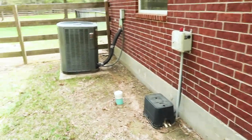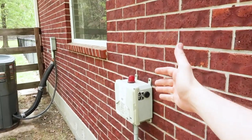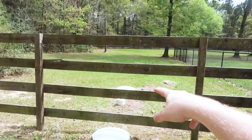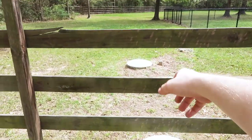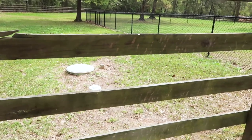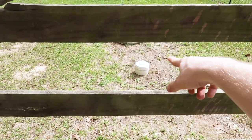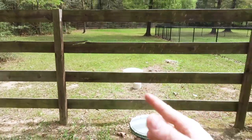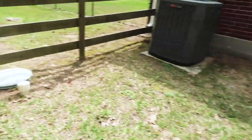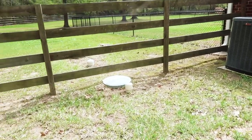We did inspect the septic system. I should have shot video before we put it all back together. The sprinkler heads weren't coming up — the aerator is just sitting on the ground and it's clogged, so it needs to be cleaned. The back tank: all the alarms did work, but the sprinkler float was straight up after we started loading it with 100-plus gallons of water and we didn't have any distribution heads show up. The sprinkler heads are damaged and they need to get this taken care of before they move in or it will flood the house. There was also no chlorine in the chlorine tab. We like to open everything up as soon as we start to make sure water is flowing into the septic system — we've had it where the water was shooting out to a ditch. You want to take extra time with the septic system and run a large volume of water through it.